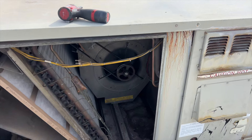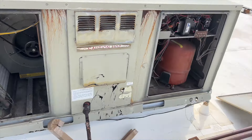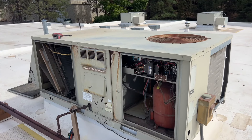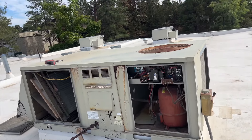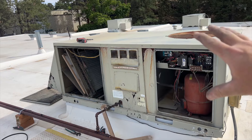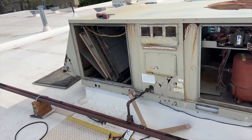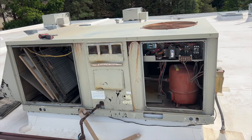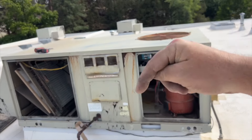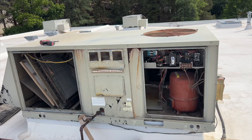I could probably tighten that belt a little bit more — I don't like how it's bouncing so much. We'll adjust that belt tension a little more and then we'll call it good. Sometimes that's what PMs are for — I came out here to swap some filters and check the unit and found dead bearings. This was a much smaller one compared to that other big Voyager unit I'll link. Anyway, hopefully this helps you out. Thanks for watching — make sure you like and subscribe, hit that bell notification, and follow me on Instagram and Facebook.